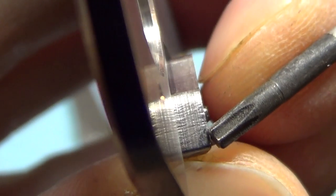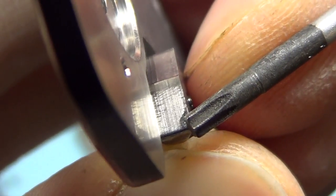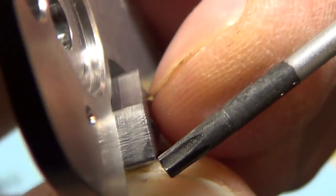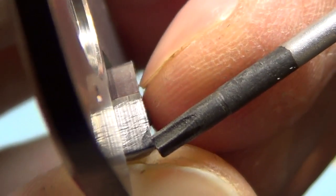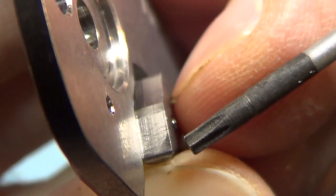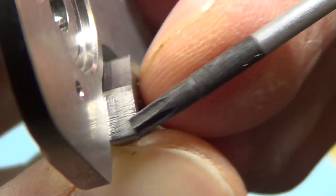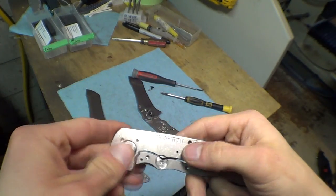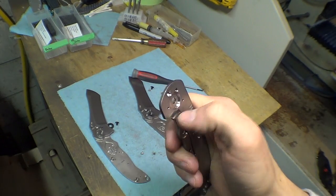You can see this little dented darker section right there. That's the actual lockup contact point. Not this whole face, not down here, not on the inside. This little corner. And you gotta get your tolerances just right, and angles and contact points and everything just right so that this little corner is doing the lockup. Check all of your high-end knives, the Hinderers and the Chris Reeves and all that. They're all gonna contact in the top corner. That's the way to make it work. Emerson's and all that. Emerson even has a little section on his website that describes how and why to do that, so it's very handy information.